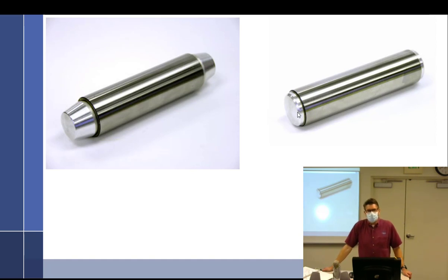Which is to say that it's new to you, old to them. Something, yeah, well, it could be recently made, but yeah, there are places that sell it. And especially the 65s, because Continental, I don't think, really services them anymore, but I think they're just counterfeit parts, and the parts don't fit well, and so the plug starts rattling back and forth inside the piston pin, and that starts wear, and then it just accelerates. That's why you just spend the money when you can. Yeah, oh boy.